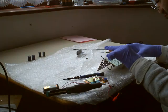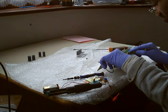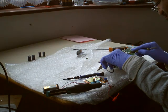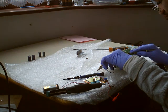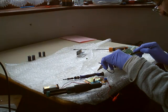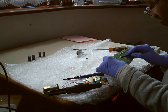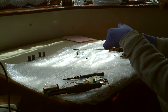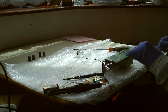Now I just want to trace where this capacitor goes — through that resistor, through the diode, straight from the transformer. And then after that it goes in here, then through this transistor here. So it might be a good idea for me to check this transistor as well. This is a B772, IC902 — it might be a good idea to check that as well.